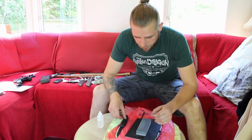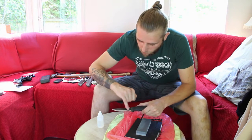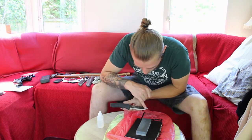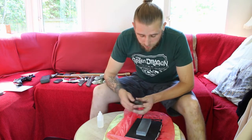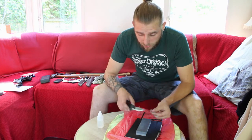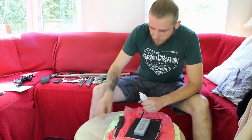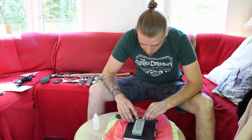I've currently spent about 40 minutes on the coarse side of the stone and you can see a real difference in the blade — the bevel has had a lot of the black paint scraped away and it's starting to look really nice and shiny. Towards the end here there's still some black paint left where I haven't done it quite evenly. I think it's starting to catch which is really cool, so I'll turn the stone over to the fine grain and do essentially the same process again. I've put the block on my leather notebook to stop it moving around.